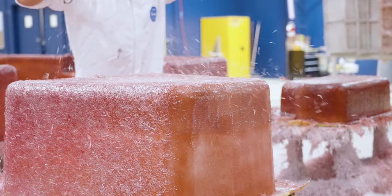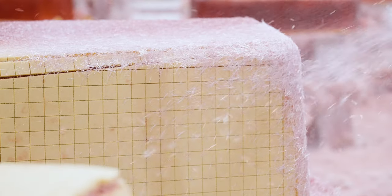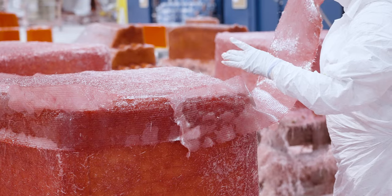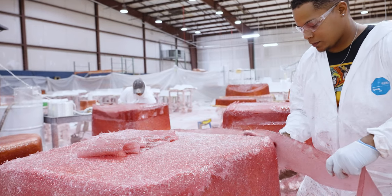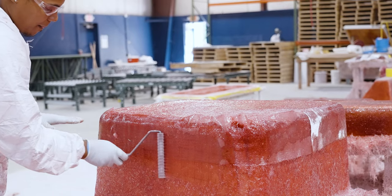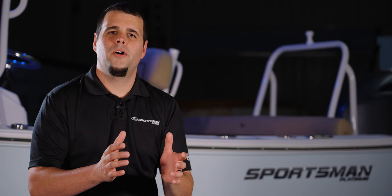Composite materials are first pre-soaked in resin and a wet bed of fiberglass is sprayed prior to applying each piece. Once the pieces are laid out, additional fiberglass is applied to the top to encapsulate the composite materials. Lastly, each part will be covered with a combination of dry precision-cut fiberglass pieces and chopped fiberglass to form the final layer. Once the part has cured, each piece is demolded.